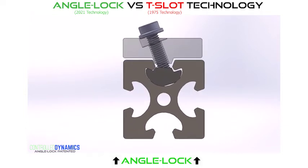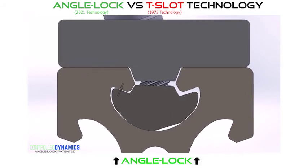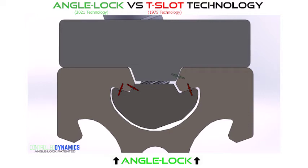The key to correcting the issues with existing T-slot fastening systems is in eliminating all pivot points by creating a mechanical lock — first anchoring the nut in two planes into the V-shaped area of the extruded profile. As the fastener is tightened, the nut rotates up and locks into the opposite side, anchoring itself into a third plane. The upper bracket then slides into position and is precision aligned to the extruded profile, creating a fourth locking plane.